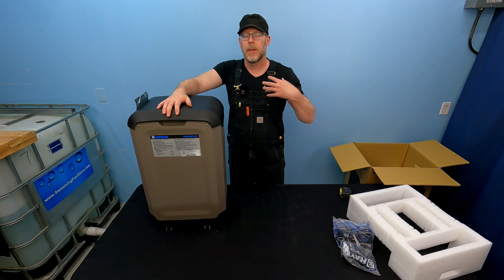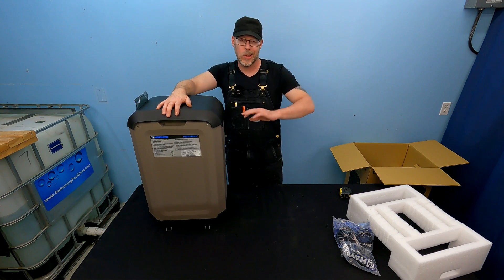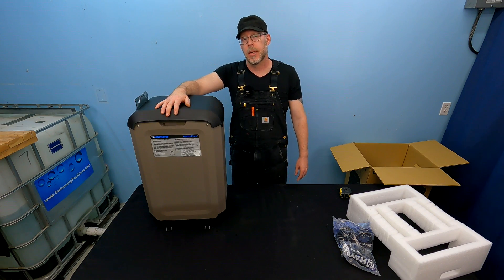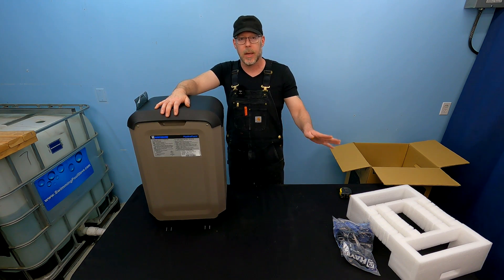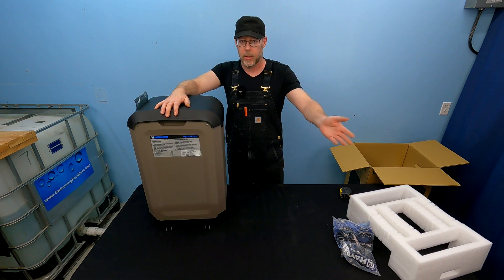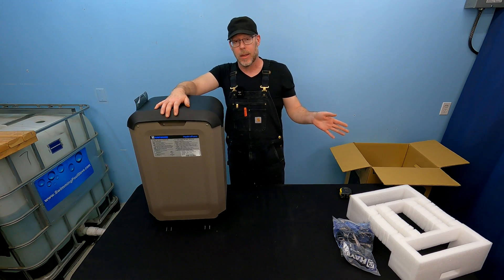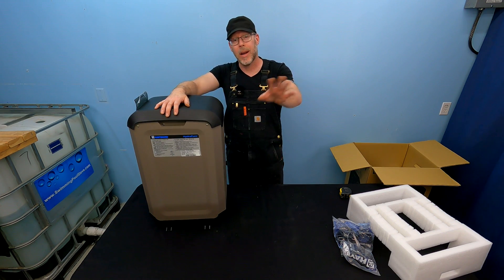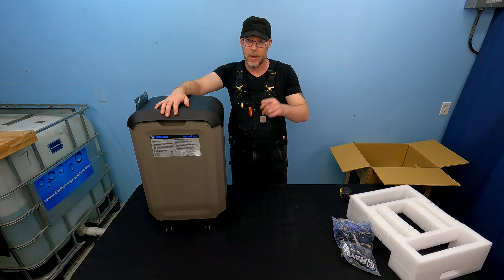These are what people wanted when saltwater chlorinators became the latest greatest thing — the idea that it just takes care of the pool for you. No, it definitely does not do that. A lot of people bought salt chlorinators thinking that was the case and were subsequently unhappy because it didn't do what they expected. All it does is generate chlorine for your day-to-day maintenance dosing, and it's not even all the chlorine — you still need chlorine for breakpoint chlorination. It doesn't do anything for pH, total alkalinity, calcium hardness, phosphate control, cyanuric acid, or any of those other things. It's hardly a maintenance-free system.